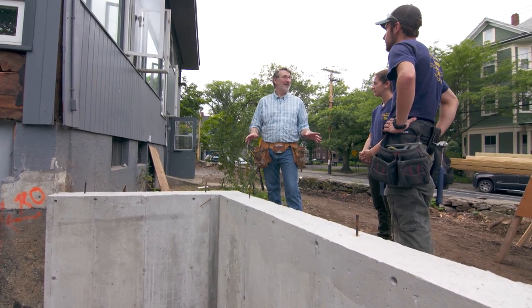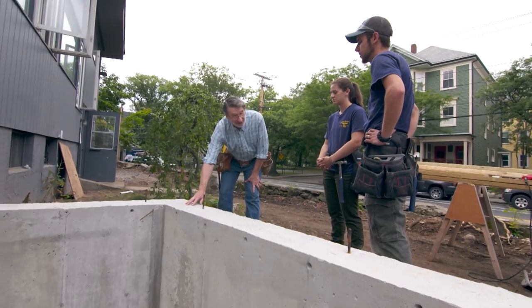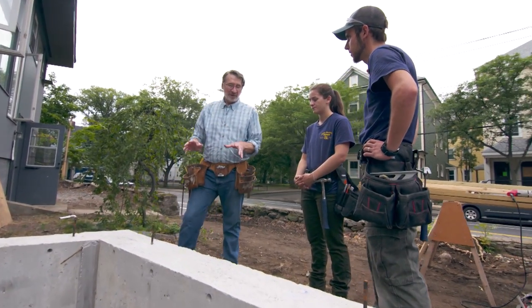The next step is we start building with wood, and the first thing we do with wood on a house is provide for the sills. That's an important part because it has to be straight and it has to be level, because now we're going to build on top of that — walls, and in other places it might be flooring. If you don't have that perfectly level and straight, you're going to have trouble all the way up.